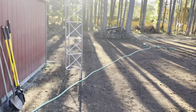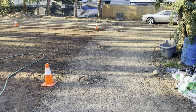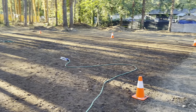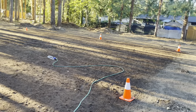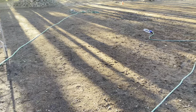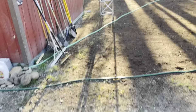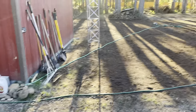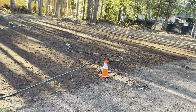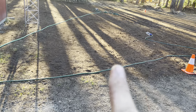Another real advantage is it's less distance for the concrete truck. With the original back-side location, the concrete truck would have to back in and have a wheel in a really soft and soggy area from watering and disturbed soil. Whereas with the new position, it's only 16 feet from the road. The truck can hug this corner, come around and stop here, and use the long chute to reach the hole. Worst case, a back tire would be in a pretty firm spot.